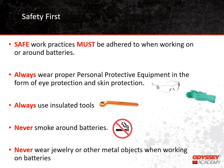To keep safety first, let's look at some of the things that people working on batteries should know. Everyone needs to understand that batteries are electrochemical storage devices that must be respected. They can cause injury under certain circumstances. You always want to wear the appropriate personal protective equipment — this means gloves to protect your hands and safety glasses to protect your eyes. Batteries are made of lead and sulfuric acid, and gloves and safety glasses go a long way in mitigating any risk. When making a connection to the battery terminals, always use insulated tools. If you've ever gotten an uninsulated wrench across a pair of battery terminals, there's no doubt you understand why — there are generally sparks that fly and quite often the wrench and battery terminals might be damaged.